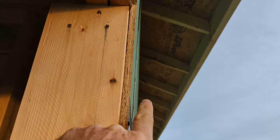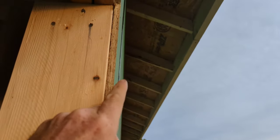The first thing you want to consider is the length of the overhang in your truss design — how far you come out. In our build, our architect had initially spec'd a 12-inch eave overhang. We bumped it out to 18 inches and I'm really glad we did. You want to keep water away from the building. Depending on your soffit material, you could go even further — two feet would be great, though vinyl soffit can make that distance more problematic.